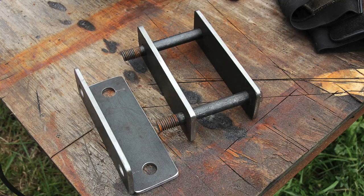Something pretty important to keep in mind: if you're going to use a step bit because you can't find a regular drill bit in the size you need, when you're dealing with anything over an eighth inch thick, the step bit probably won't be your best fit for drilling all the way through. You'll want to drill until you hit the shoulder of the next step, then flip the piece of plate over and drill from the other side. That way you don't end up with shoulders on the outside edges that are bigger than the inside of the material itself.